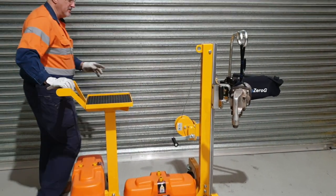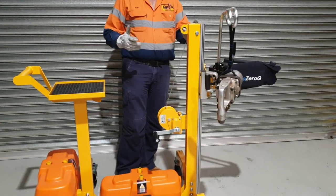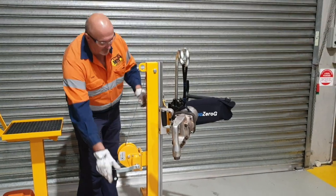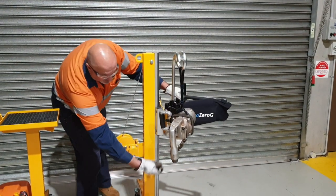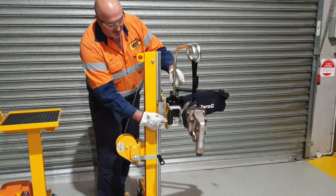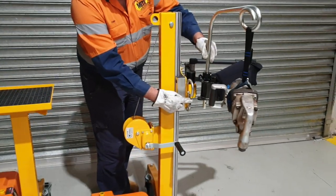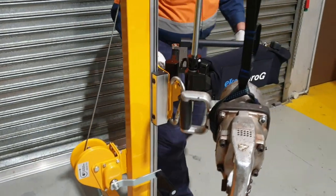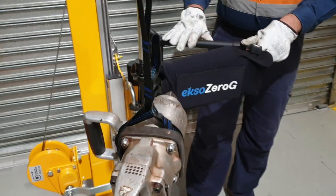We have a sturdy handle and a winch operation. Before start-up, I'm just checking the bolts are all still nice and locked in. The winch goes up and down — it works sufficiently. The gravity latch — making sure it works. The arm — just generally a check to make sure that everything's locked into position. This all looks okay.